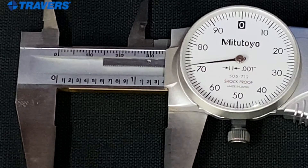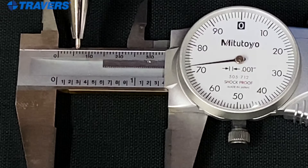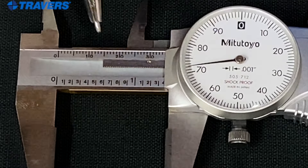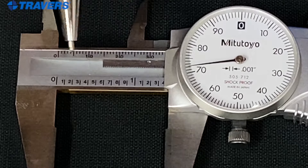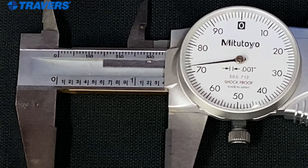Here's just a little something in case you noticed: these lines up on the top of the scale are actually in millimeters. So yes, these calipers can read in millimeters, but you can't use the dial when you're reading millimeters. So it's just a very general, inexact measurement when you're reading millimeters from an inch caliper.